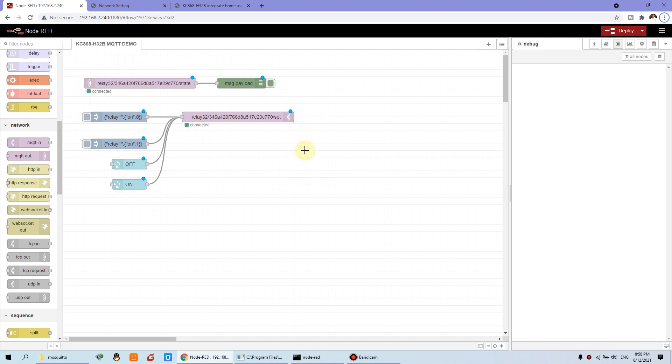You can see this is a very easy demo source code of Node-RED — just two nodes. This is for MQTT out and this is MQTT in. This is a demo like Hello World. I just tell you how to control Relay One on and off, so you will understand the principle of the MQTT control way.